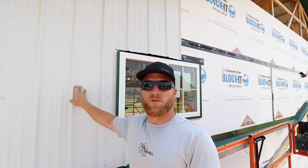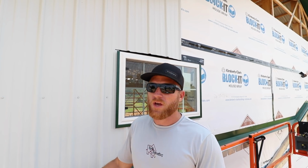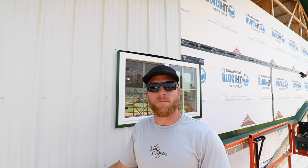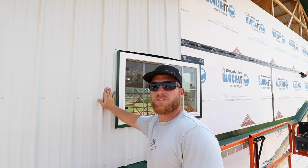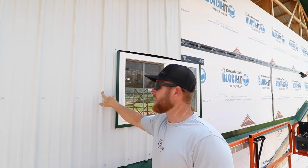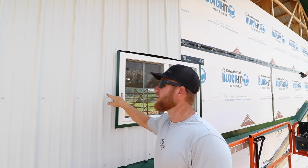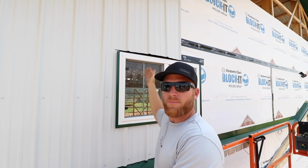All of these ribs for us are 9 inches apart. Every panel is 3 foot apart. So you've always got a reference point to measure back to. So when, let's say, getting this piece of steel measured, this rib right here, I know it's gonna be 9 inches to the next rib, it's gonna be 18 inches to the rib after that, it's gonna be 3 foot from the edge of the panel.